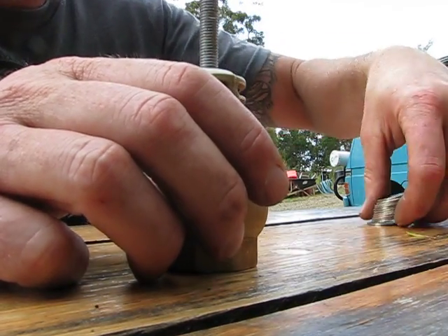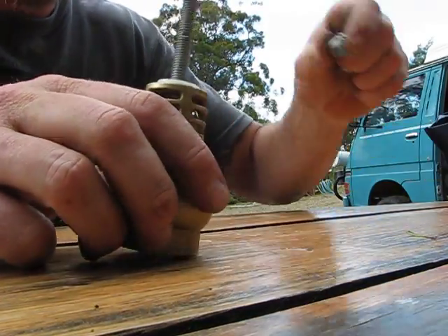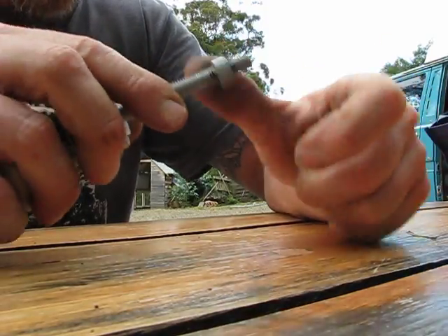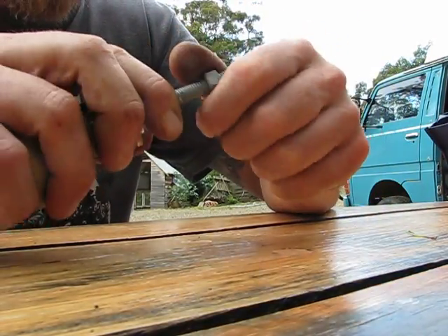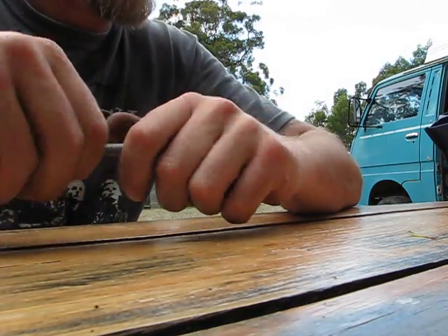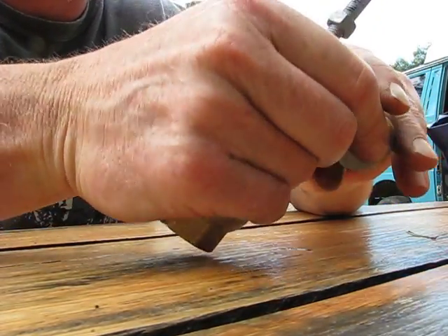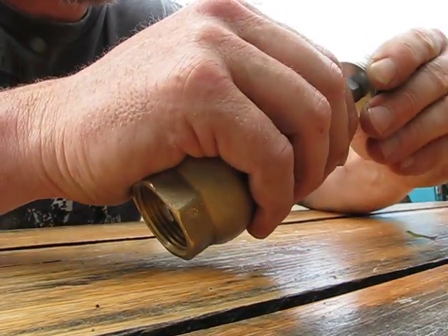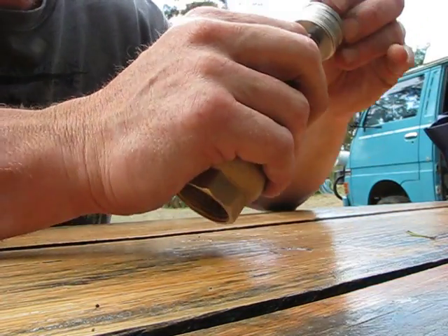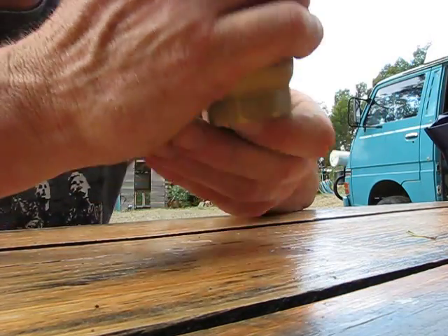So what we do now — I've got a selection of stainless steel washers. I've put one little galvanized nut on, and I'm gonna give it the full complement of washers that I've got in stock while it first starts up, because my ram pump has not been working today, and I think it's gonna help to break it in a bit better. Also, I want to see how long the stroke, or the cycle time is, with the additional weight.